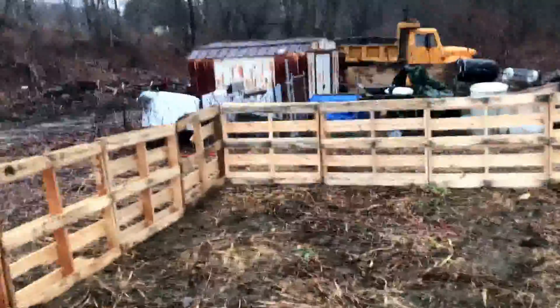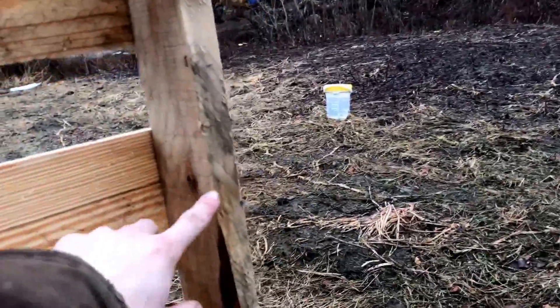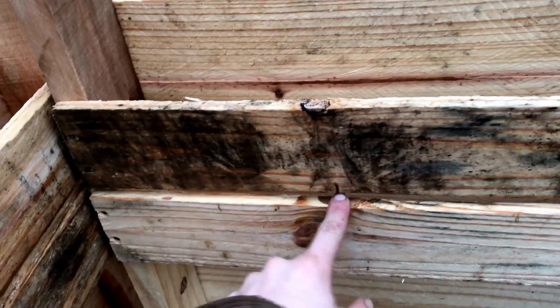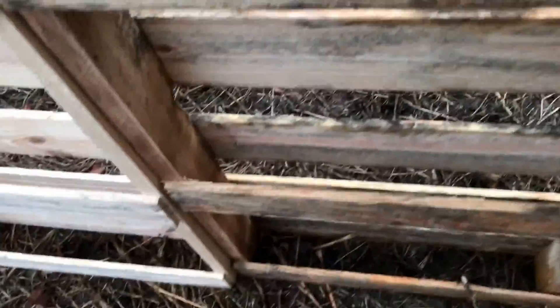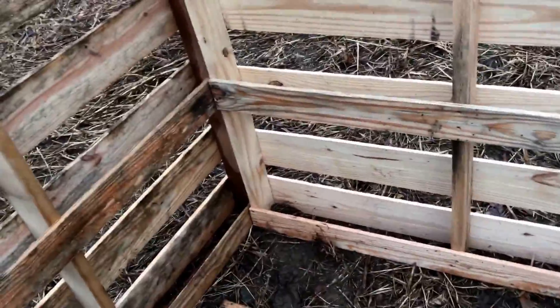This is definitely a lot more room than that puny shed over there, and it's already taller. I'm gonna take these boards right here, go from the bottom and cover them up. These boards are only 40 inches long and the pallet itself is 48 inches, so it'll come up about eight inches short, and then another board will butt up to it and help joint these together all the way around. That's gonna be the base that everything sits on, and I can screw it down because there'll be a board going across.